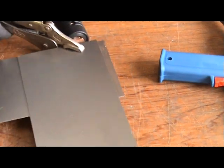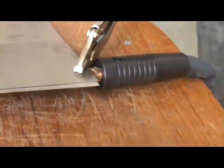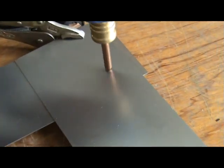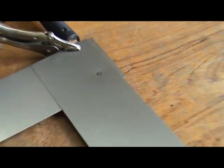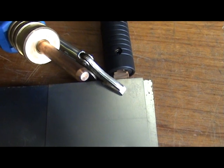We are going to do the single-sided spot welding. As you know, spot welding requires pressure, time, and power. The pressure is given by hand this time and should be applied in a proper way — more pressure and steady until the welding is finished.